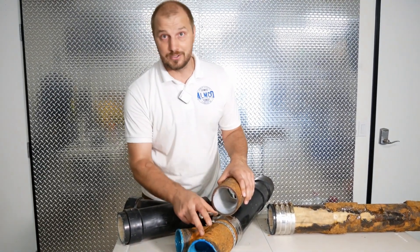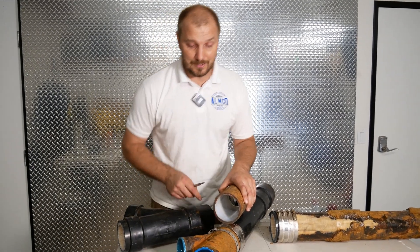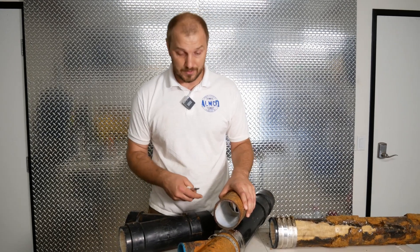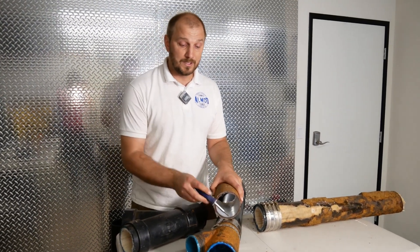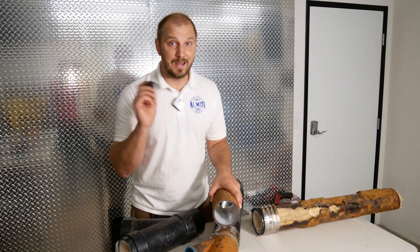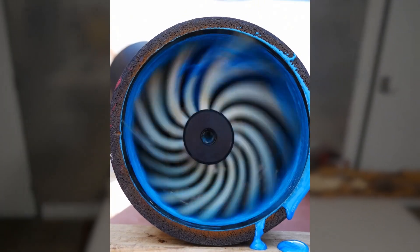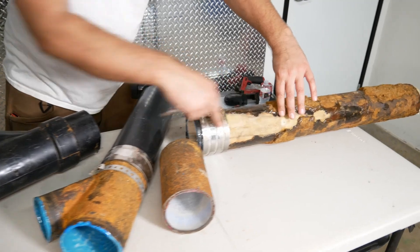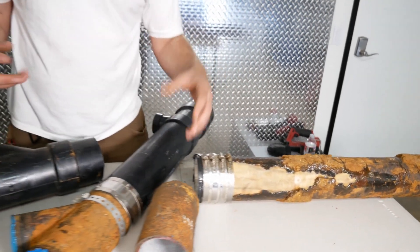Free spot means they don't touch the cast iron pipe inside — they don't line it at all. People don't understand what free spot means, but this is a big problem you will have in the future, eventually requiring jackhammering and digging because nothing else will help once the pipe collapses. But while the pipe is at least 10–15% intact, spray and brush coating can go all the way in. If we need to do spot repair, we line that section inside and you have a 100% sealed pipe.